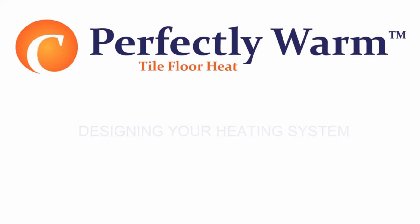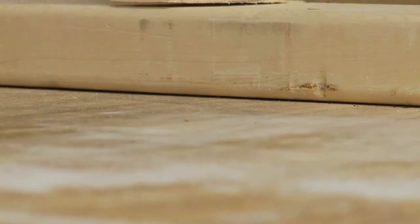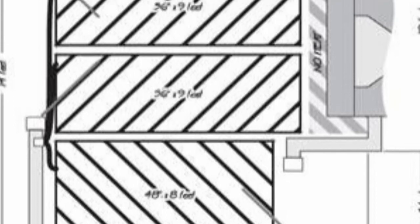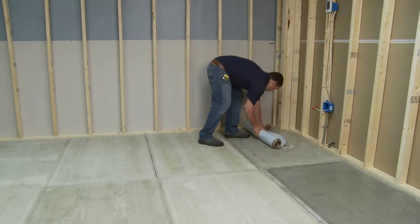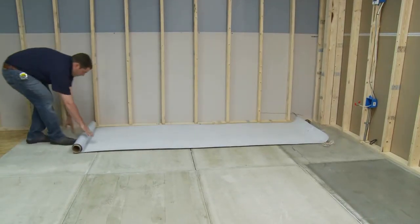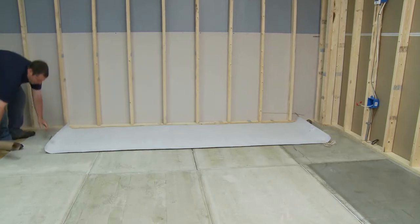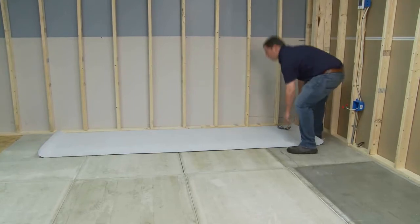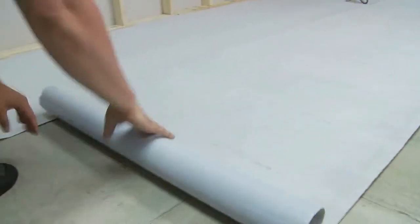When designing the heating system, care must be taken to ensure that proper clearance is maintained from fixtures which may be part of the floor. To select the proper size heating mat, measure the area to be heated and determine the heating mat widths and lengths from wall to wall. Accurate dimensions are required for proper size selection or for custom mats to be ordered and fabricated. It is important to allow up to 6 inches of clearance around the perimeter of the room and from any baseboard heating or permanent fixtures to allow the mats to fit without touching adjacent vertical surfaces or overlapping. Heating panels must be installed so that they will not be covered, even in part, by decorative trim, baseboards, or other structures on the floor.